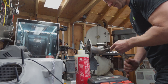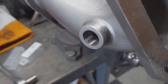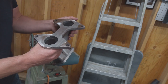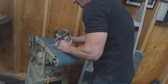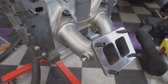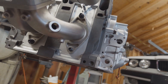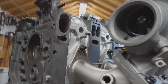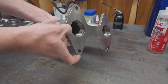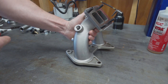I did go and invest in fresh taps for all of these because Inconel is not the easiest material to cut. Having most of the threads printed was significantly easier than starting with just the proper drill size for the tap. Next, we're on to the belt sander. The engine side of the manifold required the most cleanup — there was a small step above the exhaust ports that measured about 0.2 millimeters deep. That was nothing that an 80-grit followed by a 120-grit sanding belt wasn't able to take care of pretty quickly. Everything fits up great on the motor; turbo bolts up and is exactly in the position that we need it to be. Here we have our finished ready-to-use turbo manifold — both flanges have been belt sanded flat, with nice smooth gasket sealing surfaces, all threads cleaned up with a tap, and turbo studs installed.